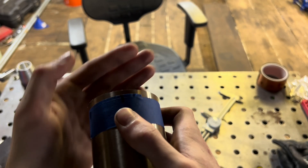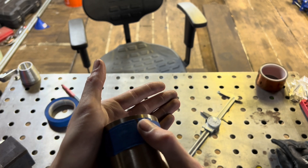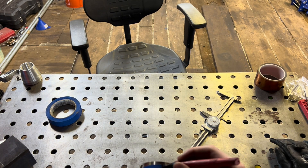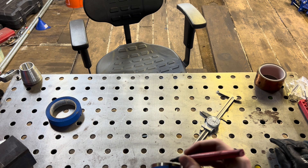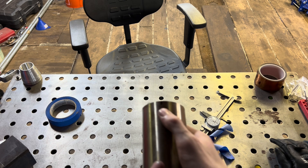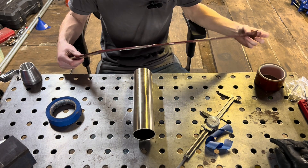You mark the line halfway between the two on this side, line this mark — the third mark, the very last one you drew when it was down on the table — up with the original mark on the pipe, then wrap it around. Check that these two marks on both layers of tape line up, then make a mark on this side where those two marks are. When you peel your tape off, you'll see one mark here and one mark perfectly across from each other.